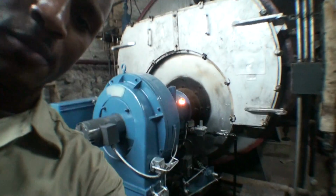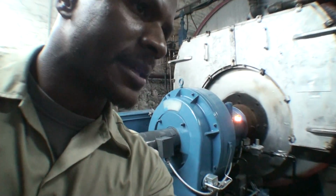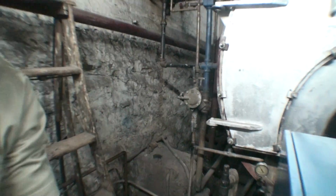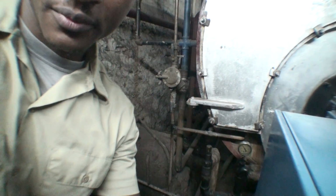Well, this should pretty much conclude this video. I'm going to throw everything back to low fire, back to auto, so it runs and holds the pressure at about 3 pounds of steam pressure. Before I even do anything else, I'm going to adjust my oil. I don't know if I can get a look in there for you. Let me see. Try to get my camcorder in there to get a look and see what I'm going to do.